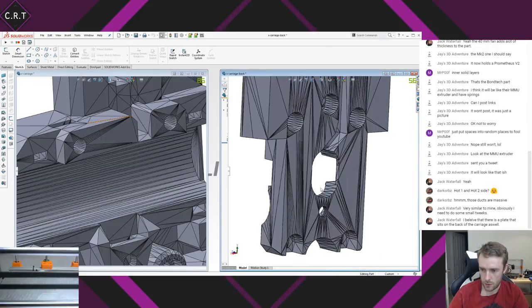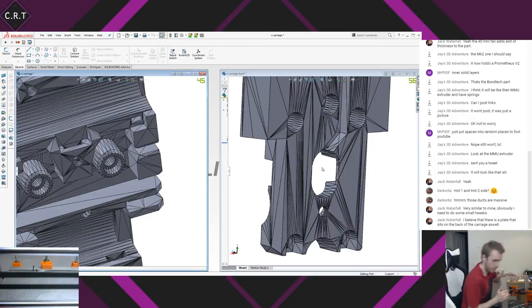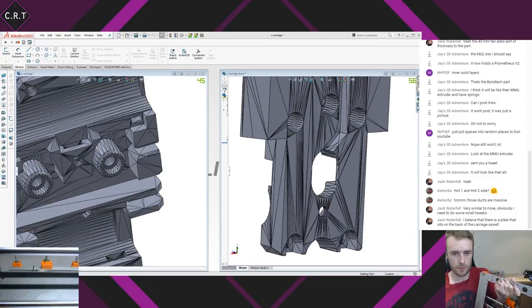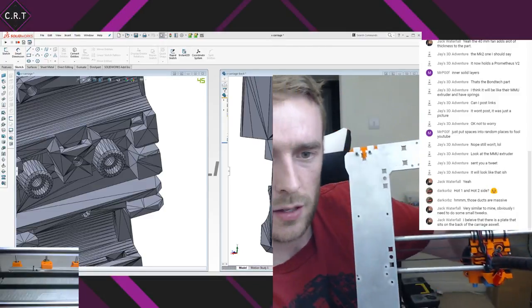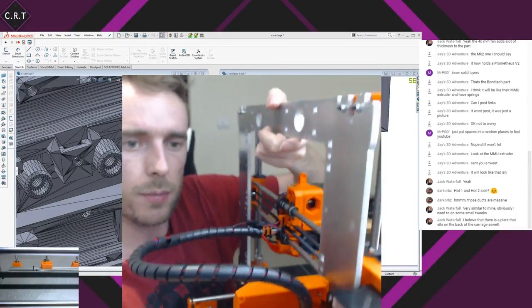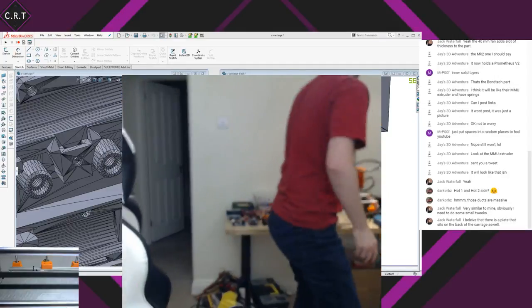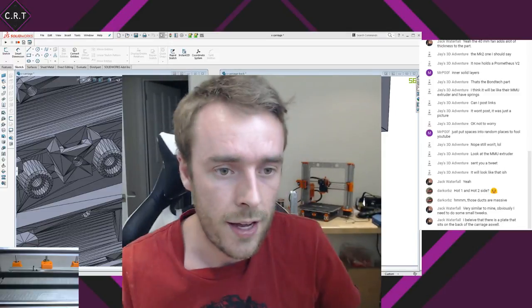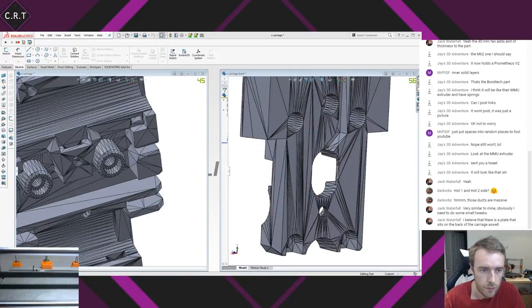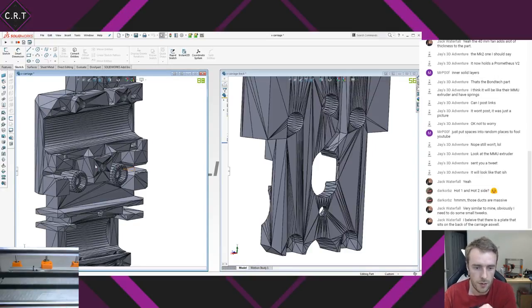Filament sensor is going to come down to this. This is where your bundle is going to sit. And it looks like, if you remember that part we looked at the beginning, that came from the spit bits at the back. So before we had this, that bit in the middle there with the big cable tie bundle just sort of sticks out the back. So that's how they're presumably going to improve that. Then you've got a square nut there, and you'll have a screw in there through that big thick plastic part, which will have the zip ties around it.